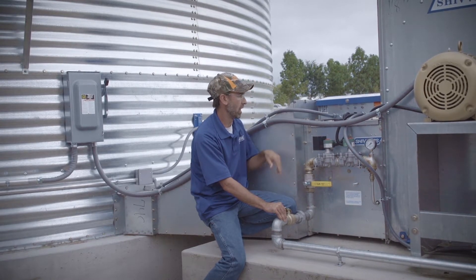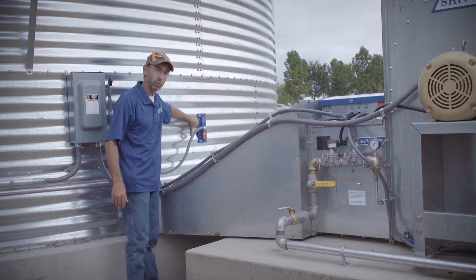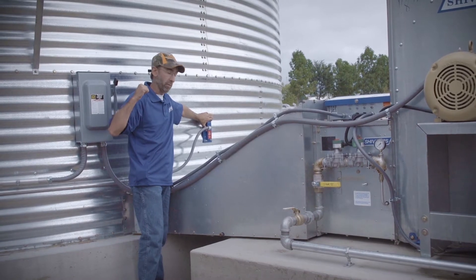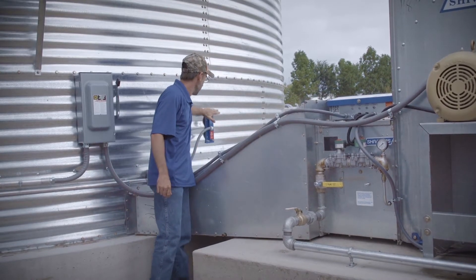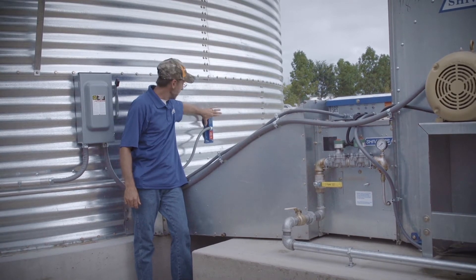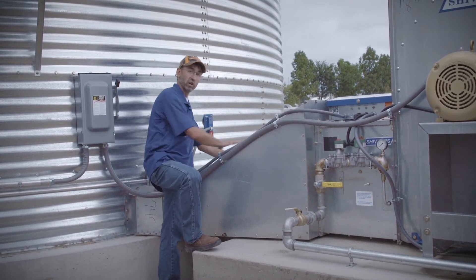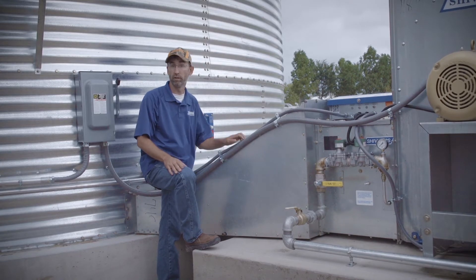We have some safety circuits on the bin wall. If the heater gets too hot or the grain temperature gets too warm, we have a grain high limit here. If our grain temperature gets up to about 200 degrees for some reason, this high limit will trigger a signal back in our premier panel. It'll open up a circuit and actually shut off the fan, which will in turn shut off the heater. This high limit will not reset until it cools down — it is an automatic reset. If this high limit ever trips, we need to verify what caused it to trip and check the grain inside the bin. That's the rundown on the fan and heater circuits.